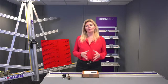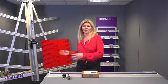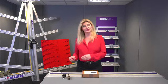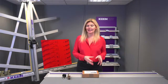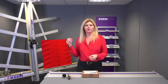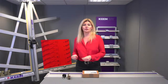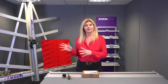You have to be really mindful when ordering a V-Groover that it corresponds with the correct thickness of board you're wanting to V-Groove. A two V-Groove goes with a two mil board, a three V-Groove goes with a three mil board, a four with four mil, and so on. You cannot calibrate a number two V-Grooving tool to V-Groove a five mil board, or a three tool to V-Groove a four mil board — it's just not possible. Today I'm going to be using a number three to V-Groove a three mil board, as that's the most common size of aluminium composite panelling.